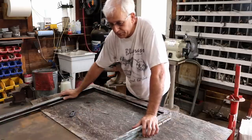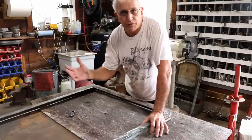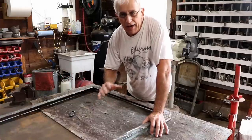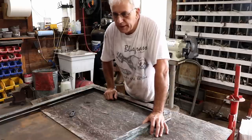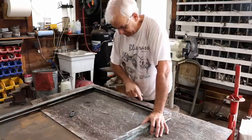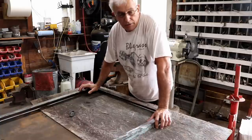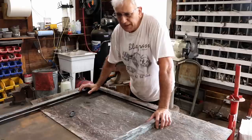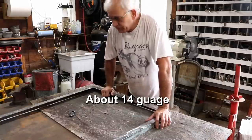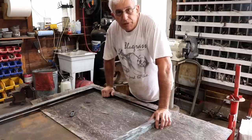I'm working on this back trailer door, and like I said, it was rusted really bad. I took a TIG welder — I'm not a good welder by the way. I'm an okay arc welder, average at best, and I mean average farm welder, not average professional welder. I can get a decent bead and get things to stick. But TIG welding is brand new to me. I practiced on these doors because they had holes all through them; I filled all the holes with TIG weld, ground them down, and I'm getting the hang of it. There's going to be a bunch of TIG welding needed on this trailer. A lot of the sides are thin sheet metal — fairly heavy for sheet metal but still thin — so TIG will give a better job than MIG or stick.